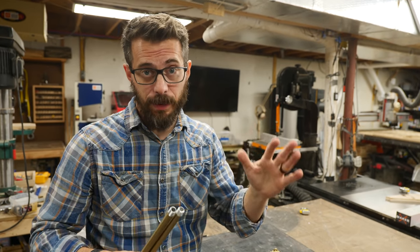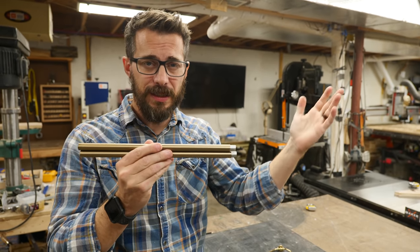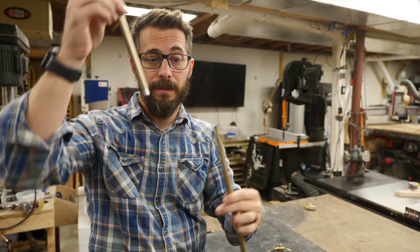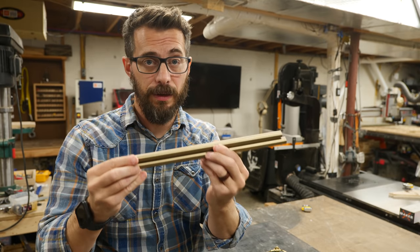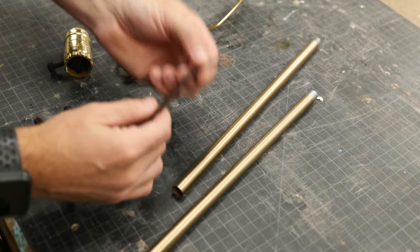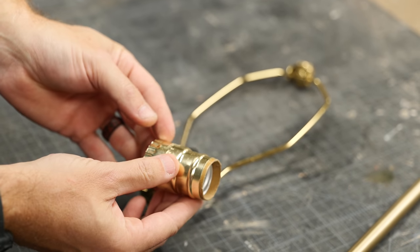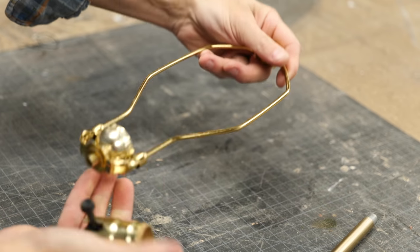The light part of this lamp is the simple part. I also wanted to explain these pieces of pipe - these came with a ceiling light we got a long time ago. It was made to hang in a really tall ceiling, but we have a short ceiling. These extra pieces came with it, and I held onto them because they have a female thread in the top and a male in the bottom so that you can stack them up. Often light fixtures will come with extra material like this that you can hang onto and use later. These pipes are hollow, so eventually I'll screw them together, cut them to the right length, and then a wire from a wire kit will go up through them. The wire kit has everything you need - the wire with the plug on the end, a really simple fixture where the wires just get screwed into terminals, the light bulb goes in there, and it also comes with mounting hardware. This piece up here holds the shade. It's everything you need for just a few dollars.